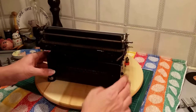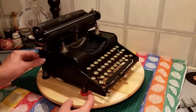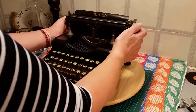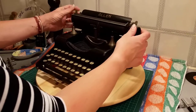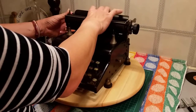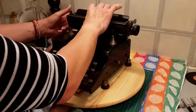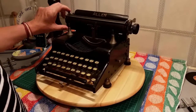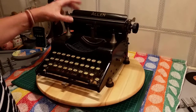Normal spring drum return and a sort of pressed steel frame. These feet look very similar to an Underwood No. 5. You've got a left-side release and a ratchet on the right to go up. And you kind of have these bunny ears — they actually release the roller so you get the page out. When you want to re-engage them, you have to re-engage it with it locked down on the handle. So release, pull them singly both — and that keeps it trapped.